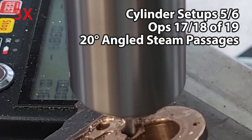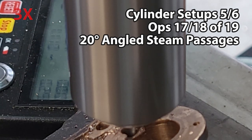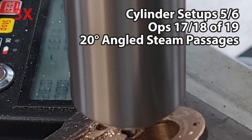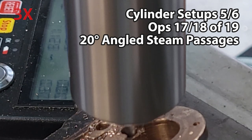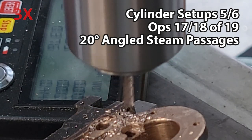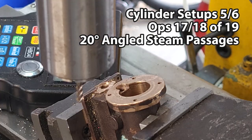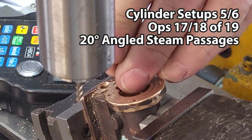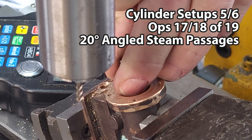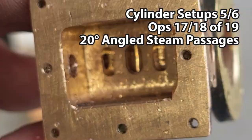It's normal to just use the milling cutter for facing here and then follow up with a drill, but as the milling cutter and the drill are the same size, the milling cutter seems to plunge quite well and it's long enough — I just decided to plunge all the way down using the milling cutter. This is an eighth-inch carbide milling cutter. I got a pack of five of them on Amazon and they seem to work quite well. I'm running at 2900 RPM.